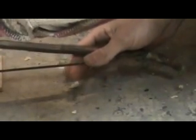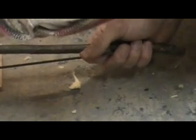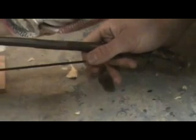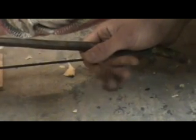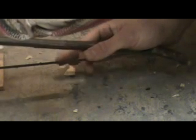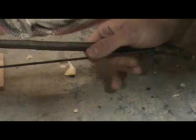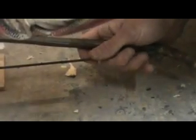Okay, I'm going to keep everything out of the way so you can see what I'm doing here. This is the end of my bow. I've got it on my drill, and let's say you got a lot of slipping problems. You either need to tighten your string. Sometimes when you got a lot of slipping problems, you go to tighten your string, and then you got the opposite problem. It's too tight and it wants to flip out on you. So just get the string to where it wants to somewhat slip. That'll be tight enough.